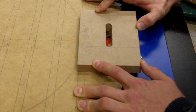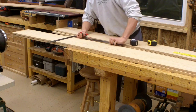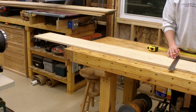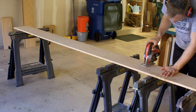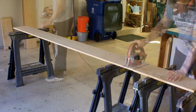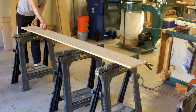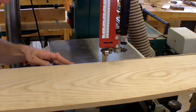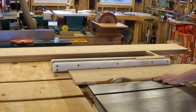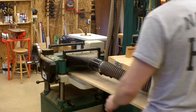Lots of routing in this project, because obviously I get to do it all again on the actual smash board. I was lucky enough to find 5/8-inch ash stock, which was perfect because the specs on the drawing called for half-inch final thickness — so I really didn't waste much material at all. I just cut it to rough length with the miter saw. To get a straight edge, I used a construction chalk line and the bandsaw since it was pretty far from straight, then put it against the fence of the table saw to get a perfectly straight edge, and milled it up.